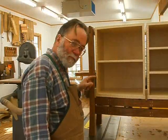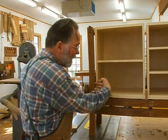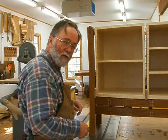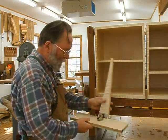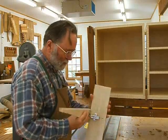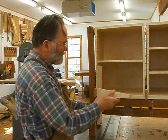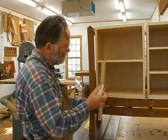Normally on a cabinet I like to use nice brass hinges — in this case I would have used brass butt hinges. But the problem is the door overlays the side, so the pivot point is such that when the door opens it would contact the leg, because the door is thicker than the distance between the box and the leg. So I'm going to use Blum European style hinges that are specially made with a 15 degree angle on the hinge. Here I've got a mock-up of the installation. This piece represents the side and this piece represents the door. When it's attached, you open the door and it slides and never passes the outside plane of the side — meaning the door can open and close without ever interfering with the leg.